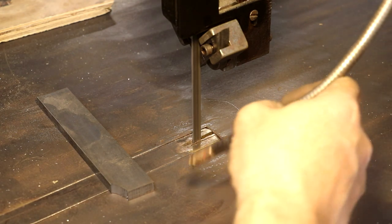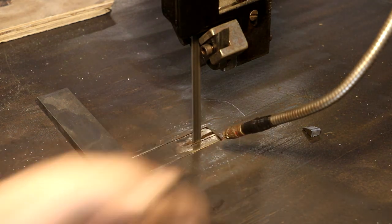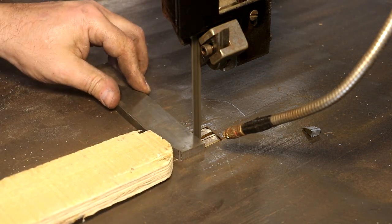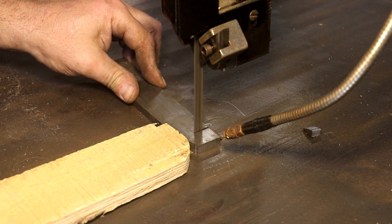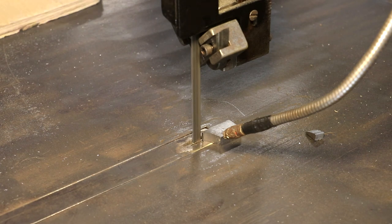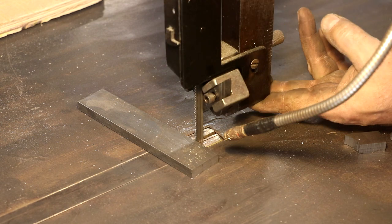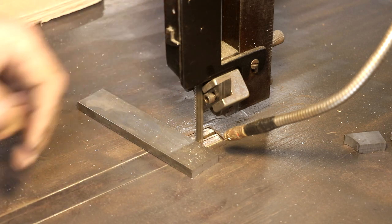The thing I noticed — this little piece here — there's actually an air pump in here that runs when you run it. It's spreading out a little small stream of air, and it just clears the chips out of your way while you're cutting. So if you've got a line scribed on there that you're cutting to, it keeps the chips out of the way. I really should have lowered that guide down a little bit closer — you always want to run your guide as close as you can for whatever thickness you're cutting. It just makes life a little bit easier and helps cover up that blade.